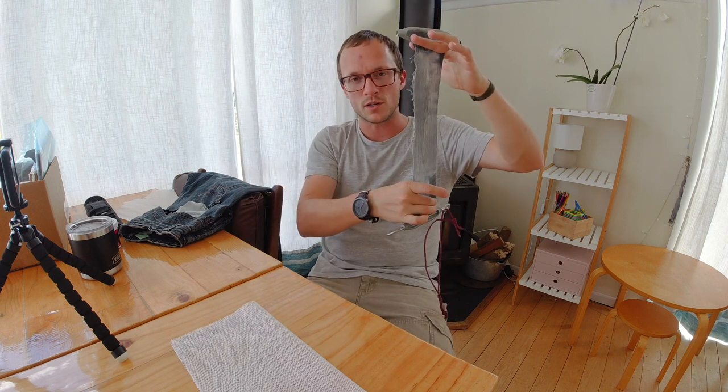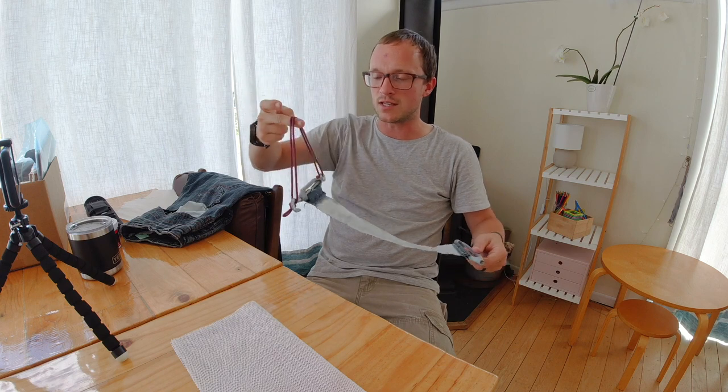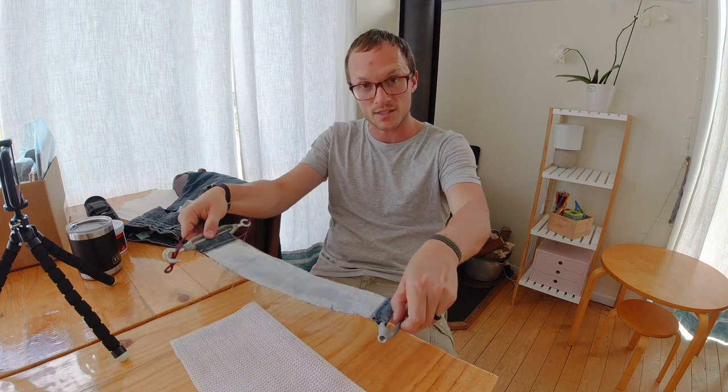Today we're going to build a hanging denim strop. You could cut a piece of denim and put two pieces of wood on it and put some screws or nails through it to hold that, but one particular feature you need is a top that is able to swivel. I've just done paracord looped through these — it's kind of ghetto — but you need to be able to hang it from the top one and have it swing freely so the knife can guide it around. You're going to load enough polish into it so you can still see the jean texture. You don't want to use it after it's dried, don't double coat it — it's kind of a disposable one-time thing. You can use one side and then the other side, but once it's dry it essentially needs to be replaced.